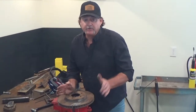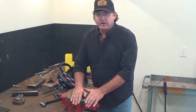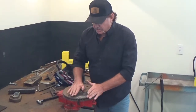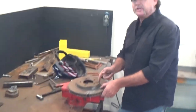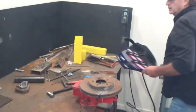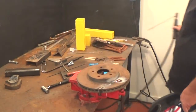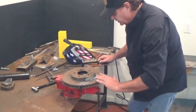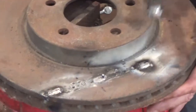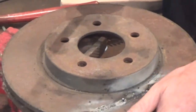Can I touch it now? Am I under 200 degrees? It's a little warm, but I'm getting there. So I'll take a little break, come back to where I can touch this. Now I'm under 200 degrees — I'm going to stitch weld, come back to the other side. Repeating the process. Nice and smooth. Look at this — beautiful. No pinholes, no porosities. Beautiful.